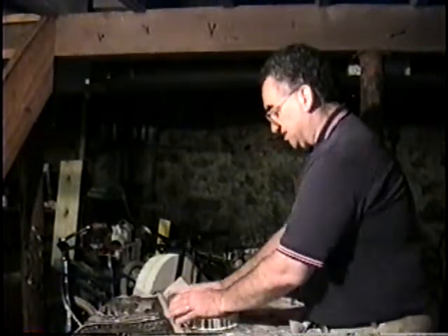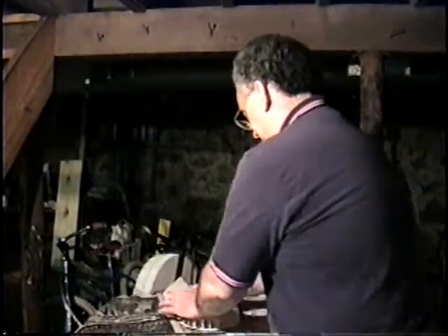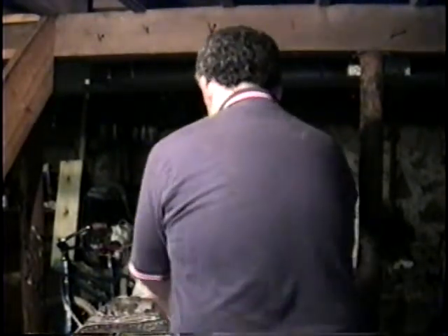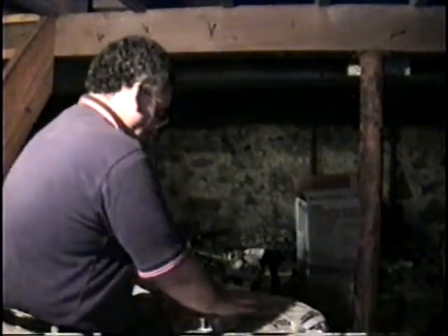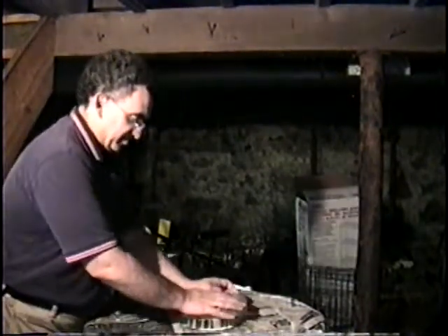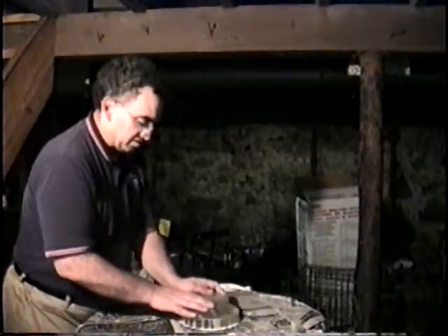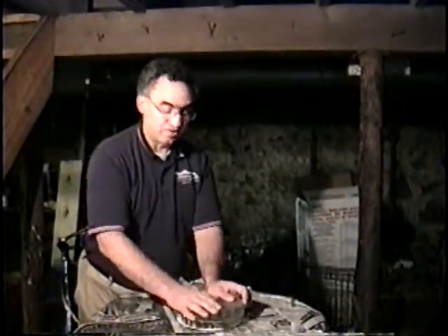I'm also learning about how the glass reacts — the chipping is important and I need to understand what, if anything, to do about it. I also want to get a feel for what a flat feels like. Right now as I'm pushing these two pieces of glass against each other, they are smooth as can be — smoother than silk. Each surface has had about eight to nine hours of glass over glass time since I began, maybe a little more including the time grinding out tooling marks. At this point the glass should be really, really flat.